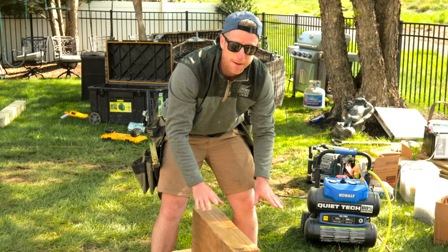See up here, all of these 2x4 notches that are taken out. That is going to allow us to put a 2x4 on the flat overhanging, and that's going to give us our gable overhang on the front to match our soffits on the sides. It's going to look really sweet. And you can also see here, now that we have these up, how this is going to be supported at our ridge.